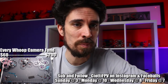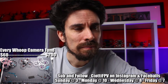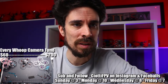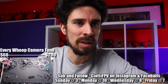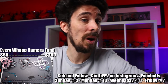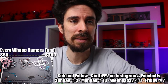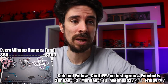Seawill says no solder, just measured from the UFL to have about 8 to 10 millimeters covered and 12.9 millimeters unshielded. Basically cutting off the lump at the top and a bit more, about half the size. I'm talking the 5.8. Oh, I've never looked up how much active element a 5.8 antenna wants. That's interesting. So it looks like it's 12.9, according to Simon.